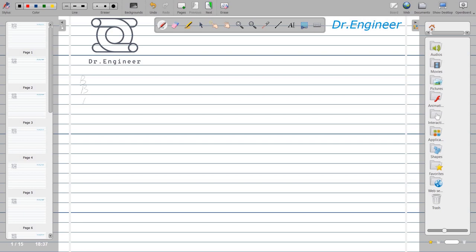B, B, R, O, Y, G, B, V, G, W. And other than this, there is gold and silver. So simply you can remember this as BB Roy, Great Britain. I used to remember in that manner: BB Roy, Great Britain, and VGW. So the values are 0, 1, 2, 3, 4, 5, and it respectively goes on 6, 7, 8, 9. Gold has a 5% tolerance, and silver has a 10% tolerance. These are tolerance values.